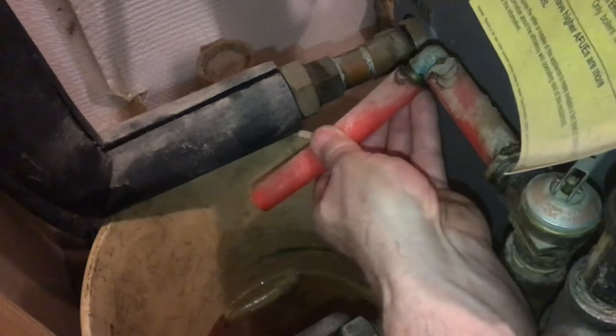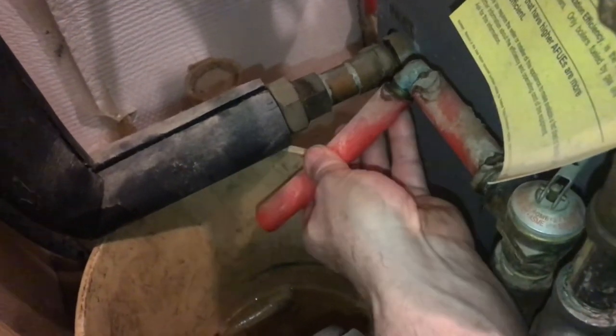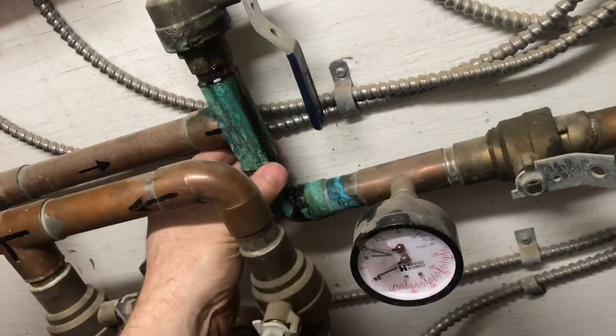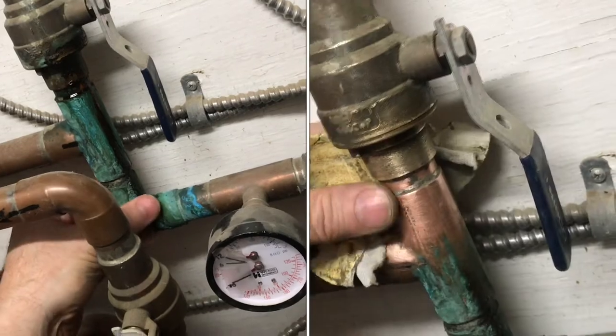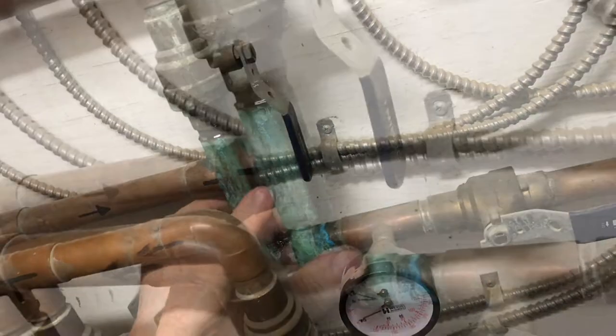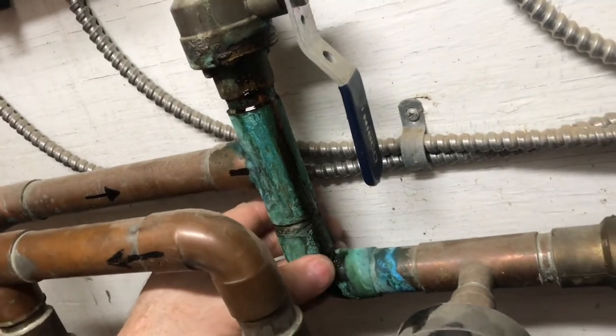Because I pumped up the pressure, there may be a little bit of fluid that's going to come out the overflow. We're not getting a lot, but a little bit, because the pressure may be just a little bit higher, and if it gets too high, the pressure relief will take care of that. There's a small leak here — you can see the discoloration on the pipe. It's been leaking for about three months.